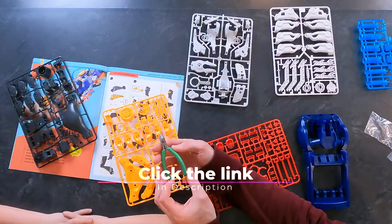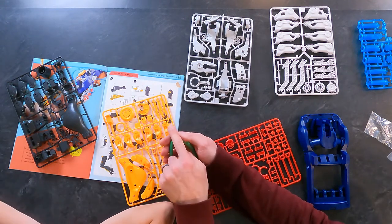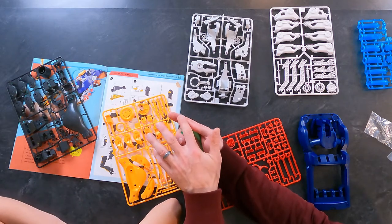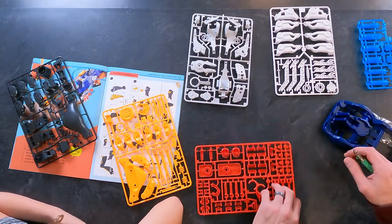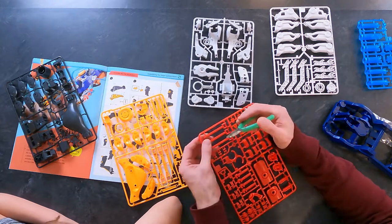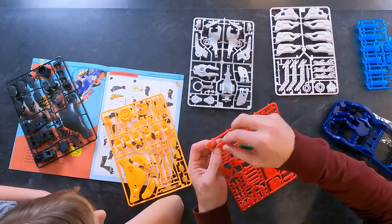These are called flush cutters. So they're not the same as normal diagonal cutters or dykes. The way that these things are made is when they're assembled and ground, they grind the top surface flat and they put the bevel on the back surface. That way, when we cut a component off of the tree, if we put our flat surface up against the finished part and we make our cut, we get a perfect disconnect without any burr.